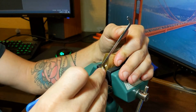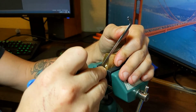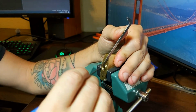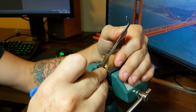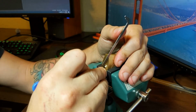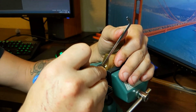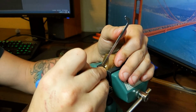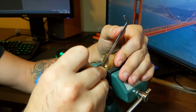So I'm going to go through searching for spools, and I'm looking for a counter rotation. Nothing on 1. Nothing on 2. Let me tighten my vise. A little bit of counter rotation on 3. That's probably the binding or the first binder, but we'll check 4 and 5 just to see if I get a little better rotation out of them. What I'm looking for when I push up on it is the one that gives me the strongest counter rotation. And there's a million different ways to do this, but that's the way that I do it.